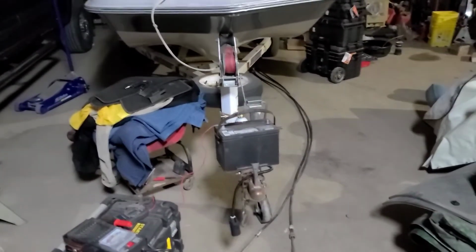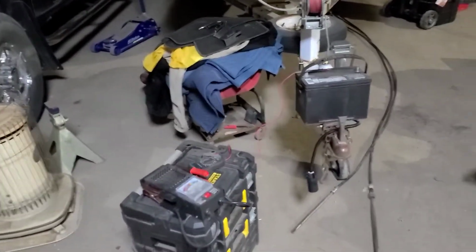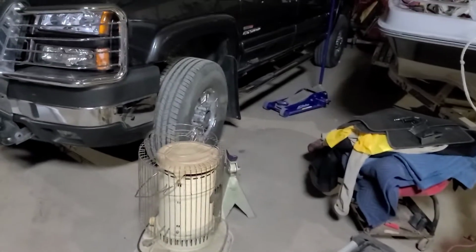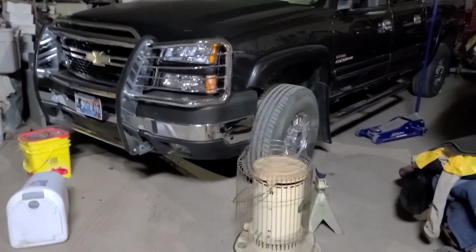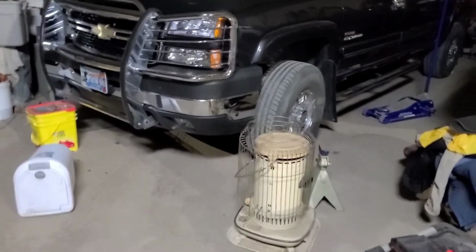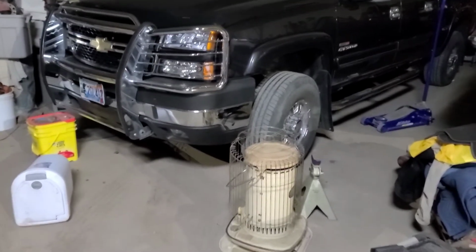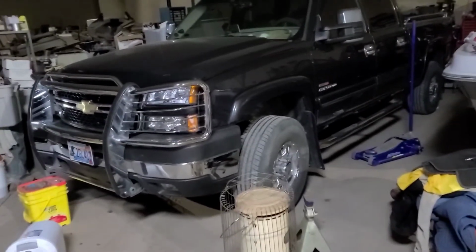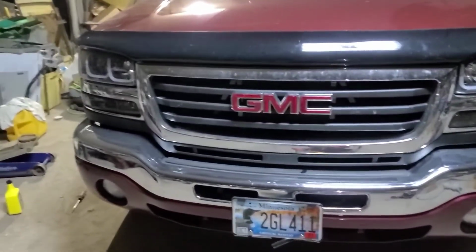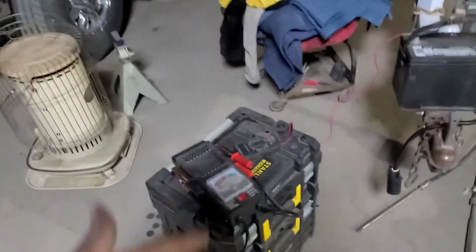The forklift had a really old battery, and I'm talking like a 15-year-old battery. That sucker was old, and the thing would start the forklift, but before I got here the forklift sat for a year, year and a half between getting started, and it would never get charged up. So you'd always have to trickle charge it back up, fire the thing up, do what you got to do, shut it off, and let it sit for another year, year and a half or more. So it was always sitting, and the battery was still starting the thing, but it was like, okay, we need a newer battery in that sucker. That battery was working pretty good, but I just don't think it's got the capacity anymore.